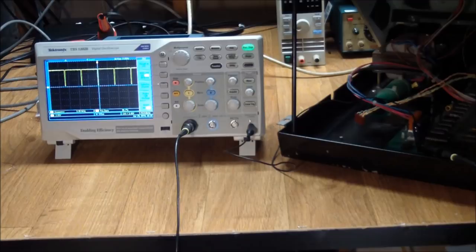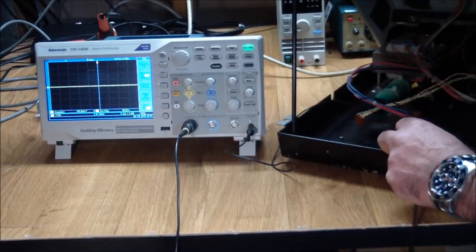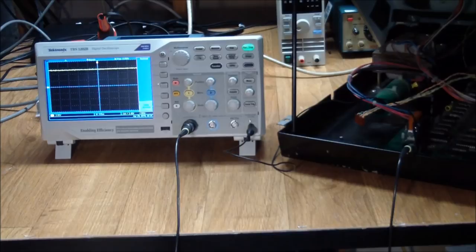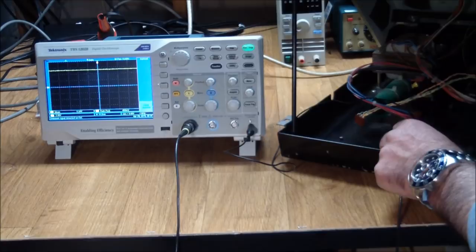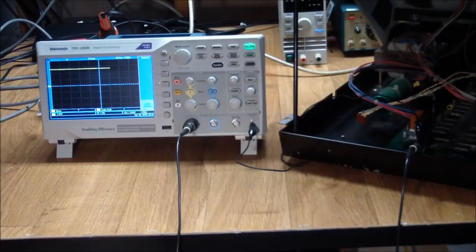And that's just odd, because you can't evenly divide 20 by something to get 6. So it's some really weird frequency that's coming out of here. And that's probably the source of our problem. Now, to continue, just for grins, having looked at those waveform plots, the vertical sync is supposed to be 60 hertz. And you know what? There's nothing coming out of it. Absolutely nothing. So horizontal is off by more than a factor of 3, vertical is dead, and finally video.